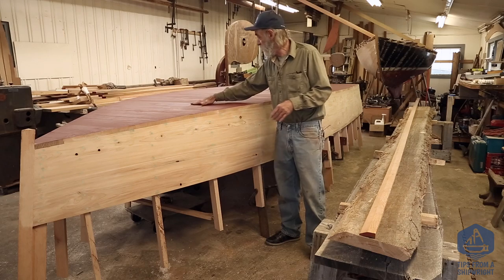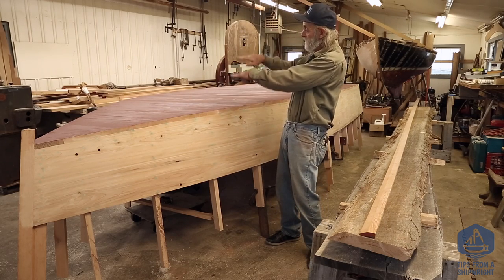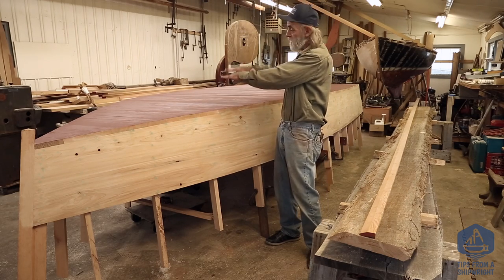You also have to have spray rails — or lift rails, what I call them — on the sides of the boat that lift the bow up as soon as it crests that following sea. They're very, very important. They also line up all the bottom planking, because the bottom planking still is not lined up perfectly until we nail those runners on there.